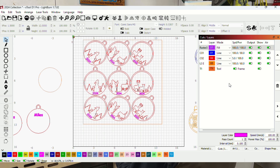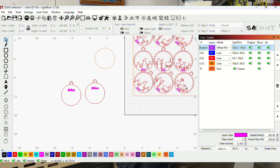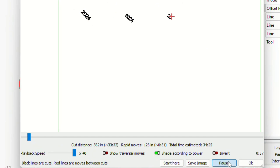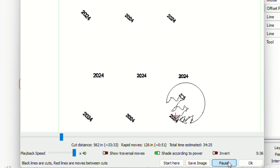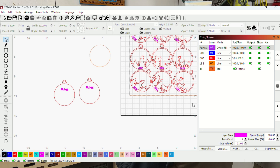We were at 41 minutes. Now here's something interesting — a lot of people wonder what offset fill is. Offset fill basically does a line around the outside shape rather than scanning back and forth across the engraving. I'm going to change this to offset fill. We were at 41 minutes roughly — now let's see how fast that is. 34 minutes. Rather than skipping back and forth, it's doing the entire '2024' all at one time, then going to the cut. I just saved six minutes off my production time, and as the saying goes, time is money.